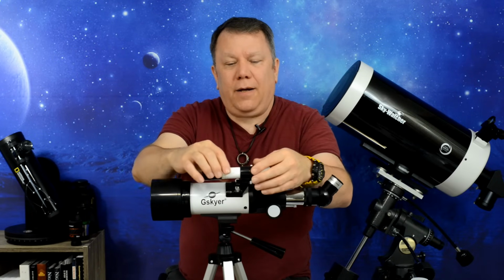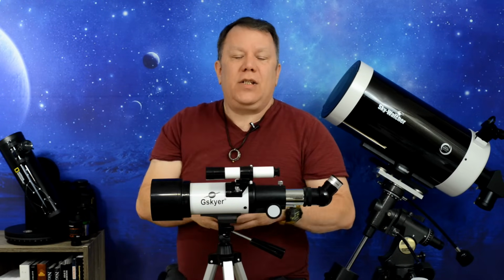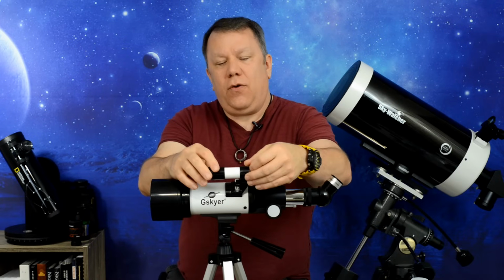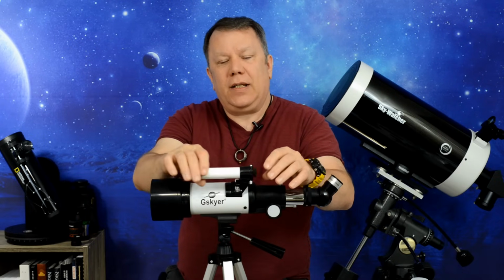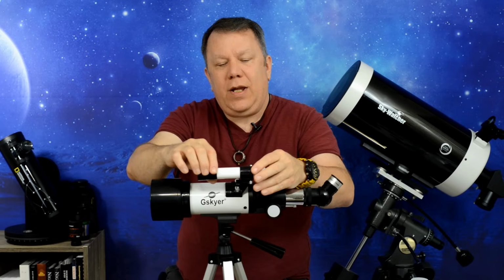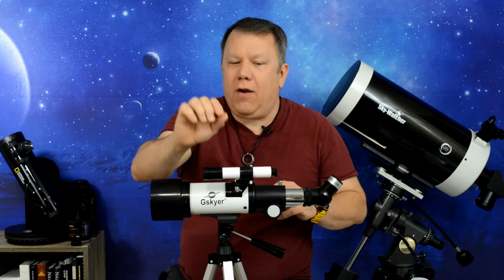And then slide it back in here. And once again, tighten these down just until they stop. Do not get over tight on this, because you'll break it. Okay. So the idea behind lining this up is that the nose of the viewfinder and the tail can be at two different places. So basically, you're going to make it do this. Okay? And the way you do that is you snug everything down. And when I say snug, I mean you very lightly turn it till it stops and quit.